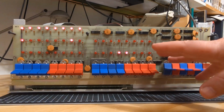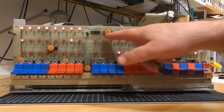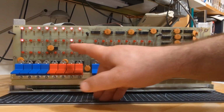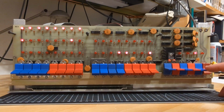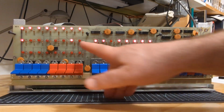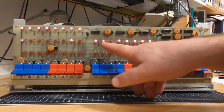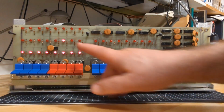As this happens, what it's doing is showing us that the CPU is... with the data in here on these LEDs, when we see the stack writing, that data is coming from the CPU itself. So let's go around one more time and double check this, because I think we got another clue here. We're not writing. We're doing a memory read. And this, again, is the restart instruction. And the next two operations are going to be writing into the stack.